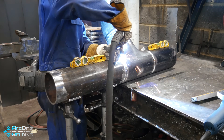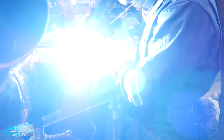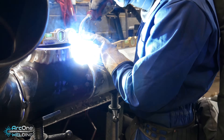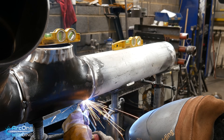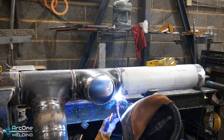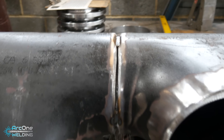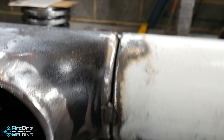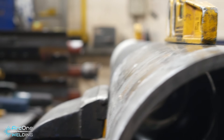I've got extra pipe to clamp in the vice so it's not so hard trying to clamp the T — I find it easier. Some people may want to clamp the T straight on the vice and add both sides of the pipe in one go; I don't like doing that. I do anything I can to avoid double handling. Majority of the fabrication is done — I just need to weld it all together. I'm leaving the flanges off because there won't be much space to get the grinder in to weld either side of the T, so I'll just do it at the end.